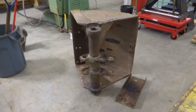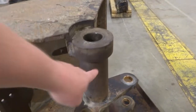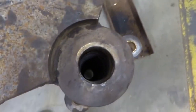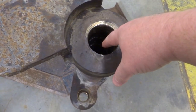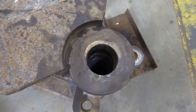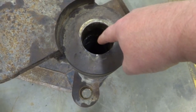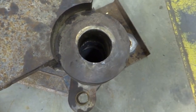If you watched those videos, you'll know that the original design had cantilevered pins. It was just a short pin that went in this hole down to about here, and then there was a bronze bushing in here. What they did — kind of a neat idea — was they welded up a round plug, a piece of steel in there, which I refer to as a grease dam. The idea was you put the pin in and there was a grease nipple in the pin; you pump the grease through the center, it goes past the pin, hits the grease dam, fills that cavity up, and then the only way it can get out is to squeeze back out between the pin and the bronze bushing.